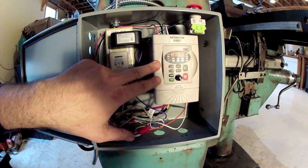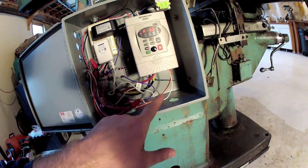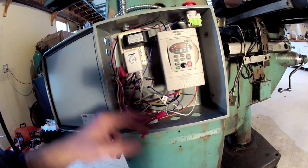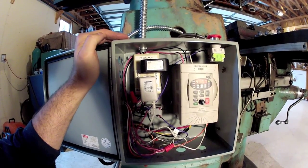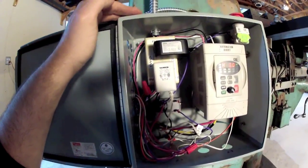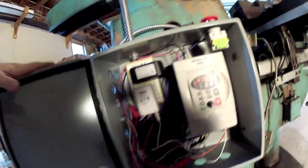If you read the instructions for the Automation Direct VFD, you might think that all of your control lines need to be shielded, but I've really only got one control line that runs remotely and that's the start and stop. It runs off of 24 volt DC provided by the Automation Direct box's onboard transformer. All the rest of my controls are 12 volt DC, so they're relatively impervious to induction current. I don't see any chance where this machine would ever accidentally start because of interference or induction in the circuits. I kept careful to run my power circuitry in completely different cables and different routings than the control circuitry. Everything's inside armor cables that pass through the machine and gives me fairly nice clean lines.